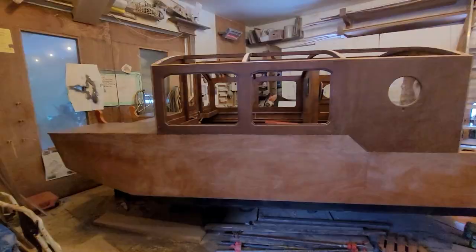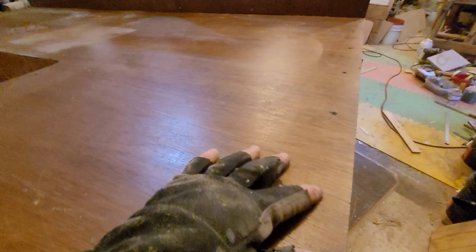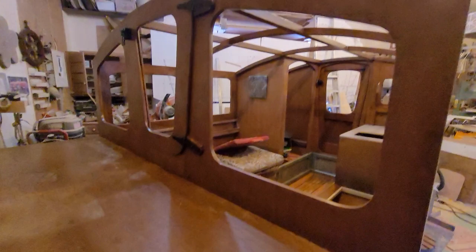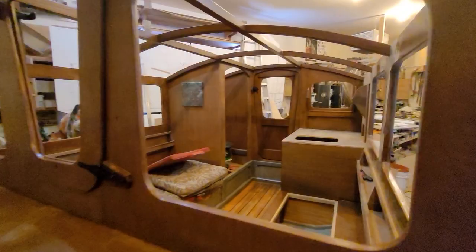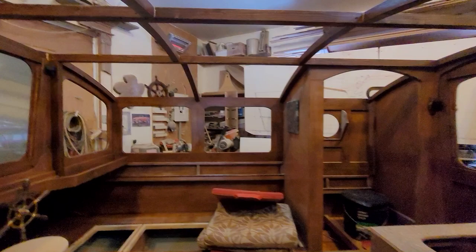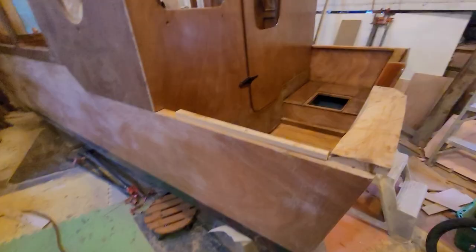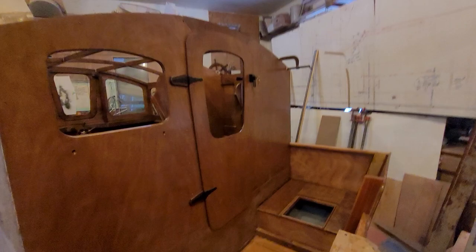Tomorrow evening I'm looking at being in a happy mood. This is a nice transition - I was a bit bummed because when I dry fitted everything, everything had to come all apart, but now it is all back together for the most part permanently. It's looking really nice. I do have to replace these drywall screws - that's just to bed this, but it's on pretty tight. Let's just take a walk around. The roof beams are all glued. I'll have to come back and clean out some of the construction adhesive. My experience with PL Premium is that it's very strong and lasts really well but it's a bit of a mess.